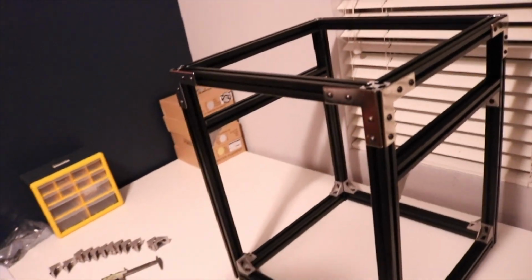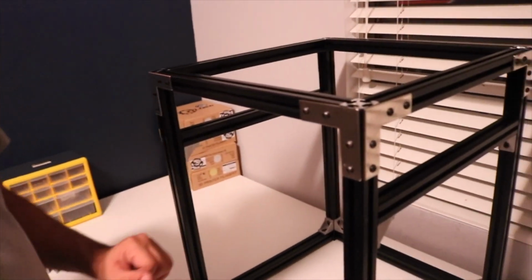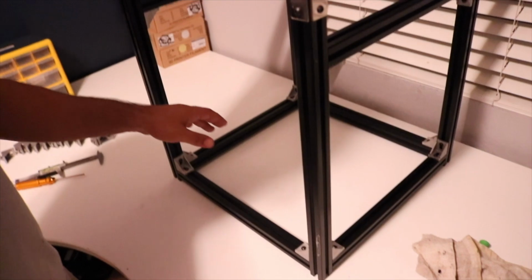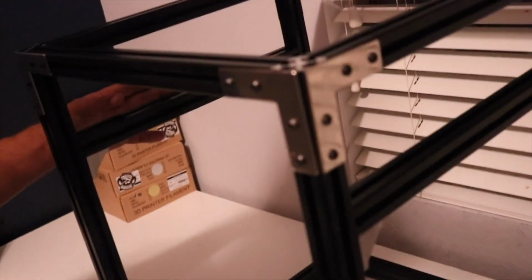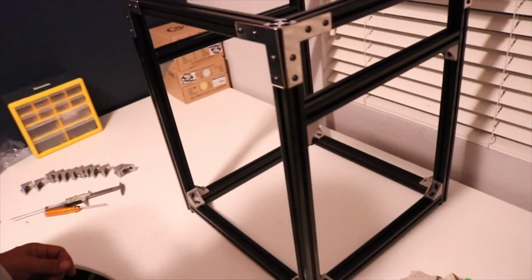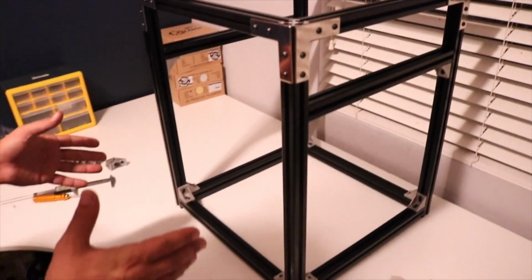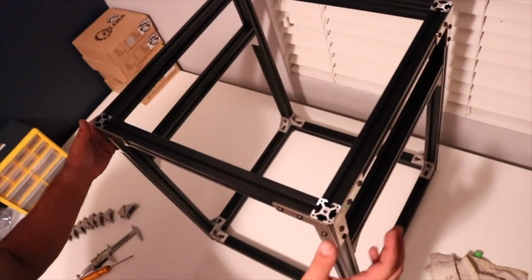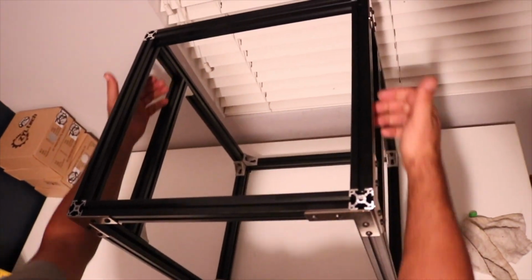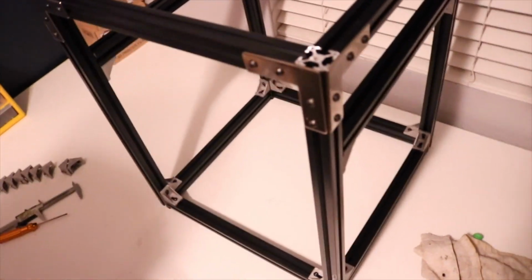So in the next video, we will be starting with the bed frame assembly and the Z-axis. So we will do the linear rod holders on top and bottom, along with the motor mounts, the feet, and the upper linear rod holders. Once we get that all done, we will go ahead and install the bed loosely so that we can shift it back and forth. Then we'll move on to the X and Y motor mounts with the X and Y idler mounts and the X-axis carriage. So that's where we're going to pick up where we leave off here.